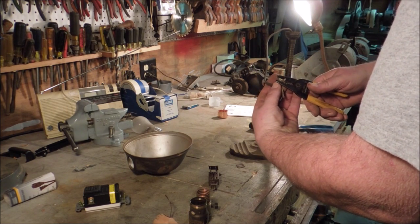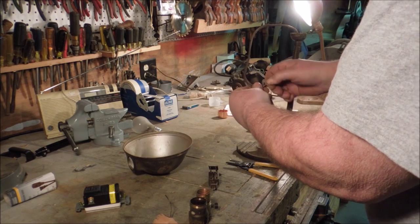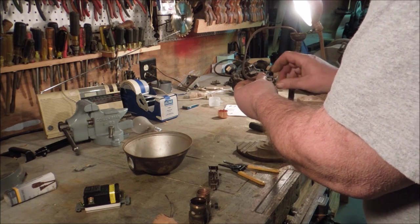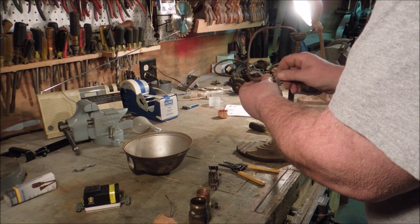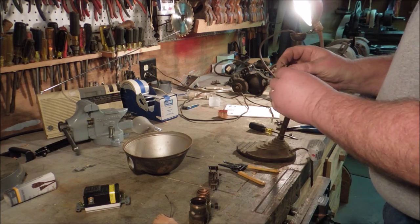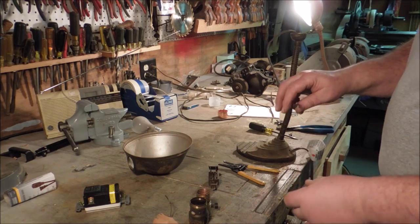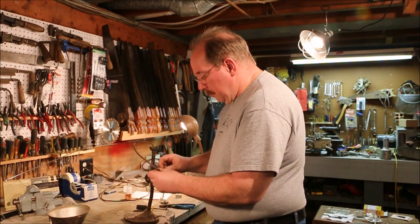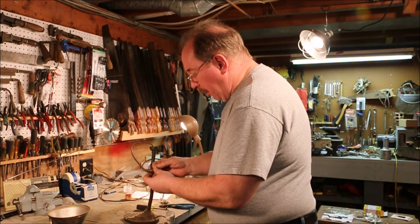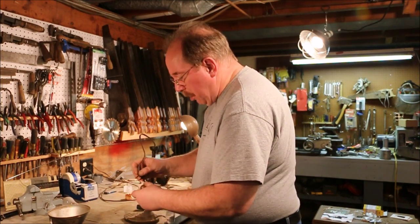I'm going to take our wire strippers — you can do this with a jackknife or with diagonal cutters, but wire strippers just make the job a little easier. You want at least a half inch of wire exposed; you don't want a lot more than that because that wire is going to be just extra material hanging around inside the socket. I'm going to slip that cardboard disc back down into the socket — that's insulation. After I've stripped the wires back about a half inch, I twist the wires together, then I form them into a loop. I want to have a little C-shaped loop so that it goes around the base of the screw.